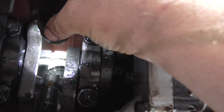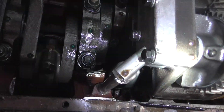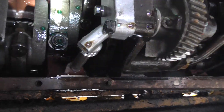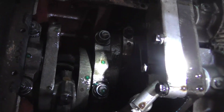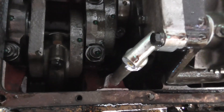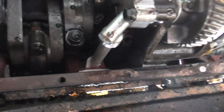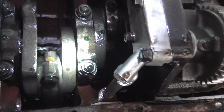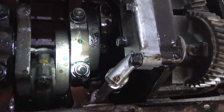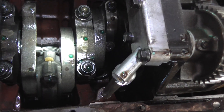Up the top there you can see it's leaking out of the base of the cylinder liner. It looks in pretty good condition actually — it's very clean. These older machines usually have a lot of gunge in the sump. This one is not too bad, but it's definitely number four cylinder leaking the worst. Number one is also leaking, and number one is going to be removed because of slight piston damage. The main fault — coolant in the oil — is caused by the bottom joints on number four cylinder liner.